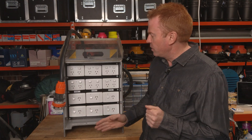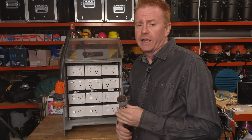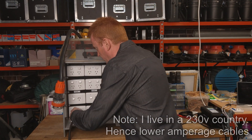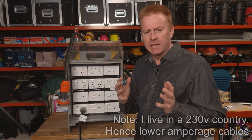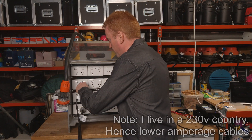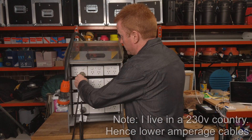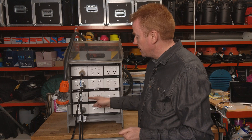Now I'm going to give you a tip to help you keep track of what your load is on each phase. If I'm running a big light like a studio 5k or a 4k HMI, the big lights plug into the bottom row. A medium-sized light like a blondie or an M18 plugs into the middle row. Something with a small power draw like an LED panel goes into the top row. So when I look down a phase I know I've got a small light, a medium light, and a large light plugged in.